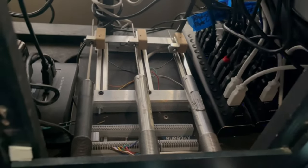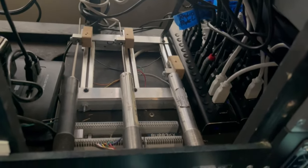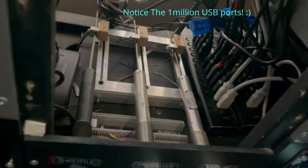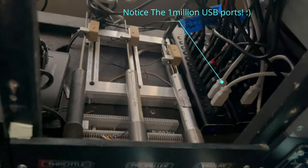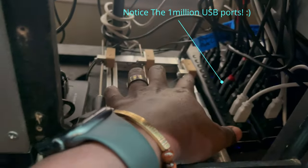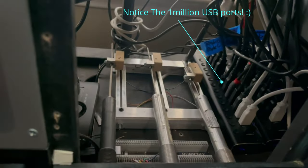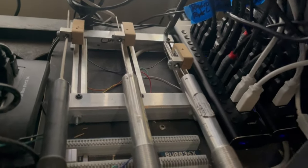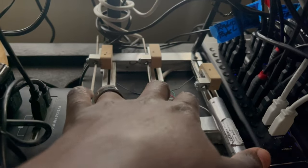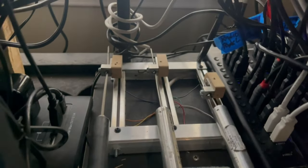And that's why I opened that panel. You can see when I move the mixture, this is the back here. The red is the mixture, this unit. I cut off the excess cables. These come with a very long, 4-foot steel metal cable. I had to cut that off and also cut the internal little wire piece to a desired length that I wanted at the time. And what I did is I hooked that up to these 100 millimeter slide potentiometers. I have three of them, one for the throttle, for the prop, and for the mixture over here.